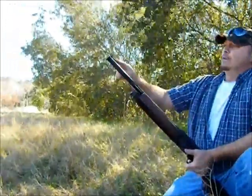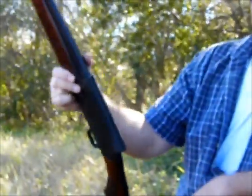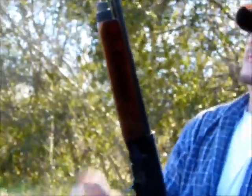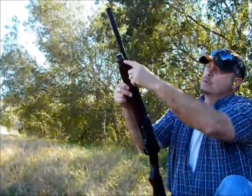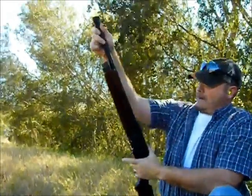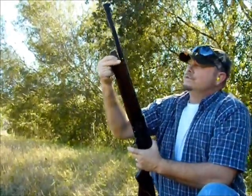I welded a rifle sight up here, cut the barrel back, opened it up just a little bit, welded on a rifle-type sight, and replaced the forearm that cracked on me last week. I got this at Numrich Gun Parts, e-gunparts.com. This one is a little bit shorter and it's got a shock-absorbing piece of Delrin up here right underneath the magazine cap nut. When this whole barrel recoils down into the action and slams back forward, it's supposed to absorb that recoil.